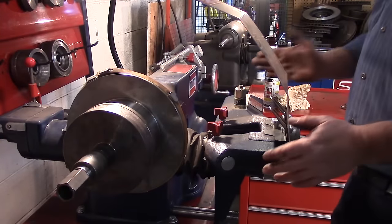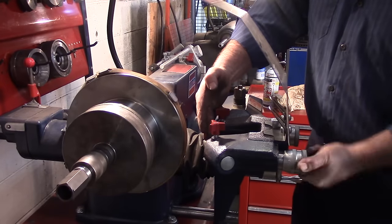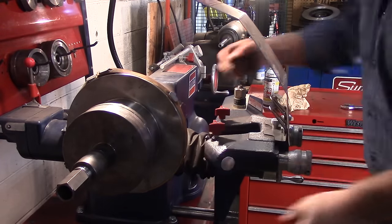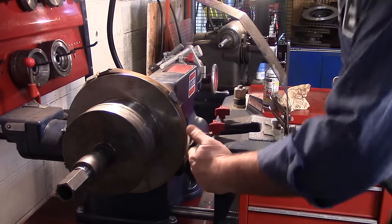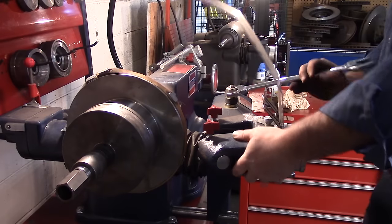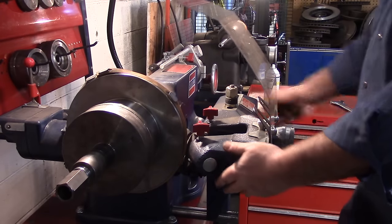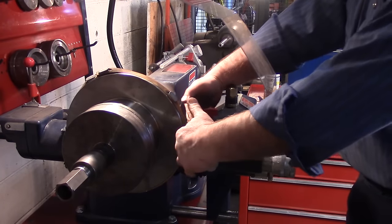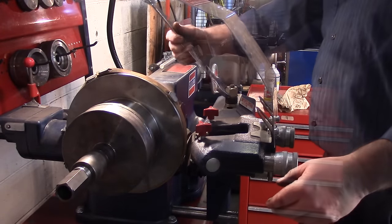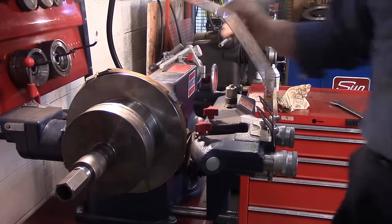Next, I have to set up the facing tool. It needs to be adjusted a little bit. I'm going to back off the locks and back off my cutters an equal amount before centering the facing tool. I've brought both cutters back enough for this rotor. I'll loosen the nut on the facing tool and center it so the rotor comes right into the slot. With the cutting bits backed off, there's no interference.